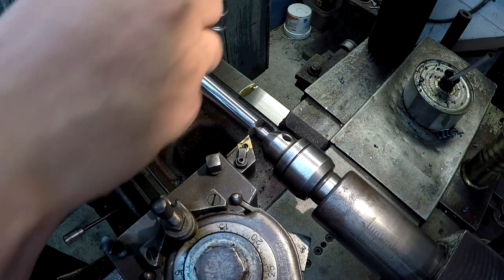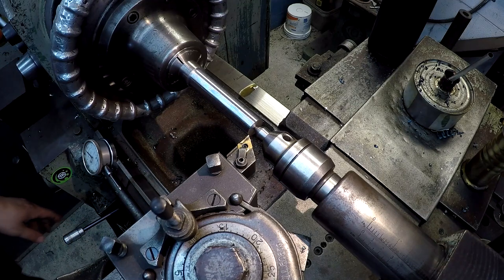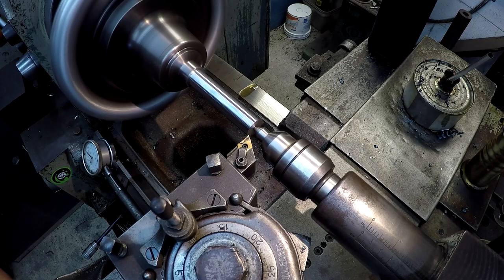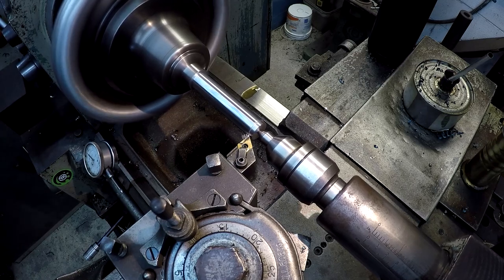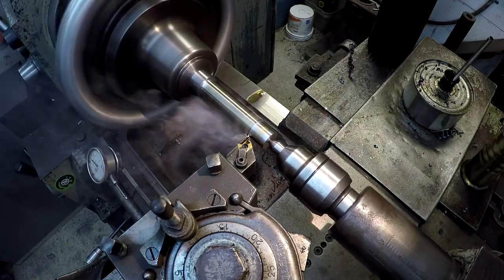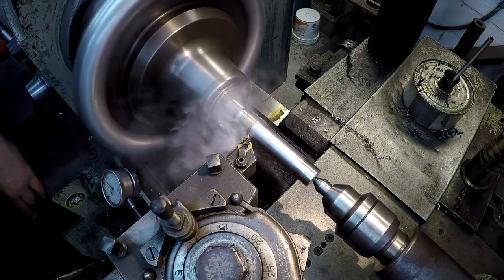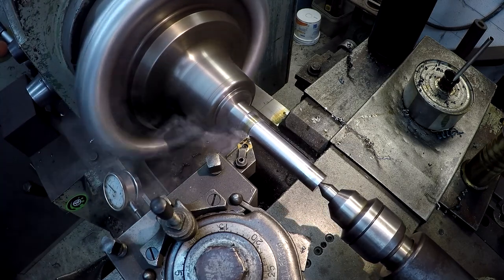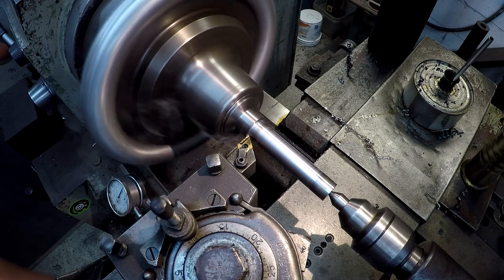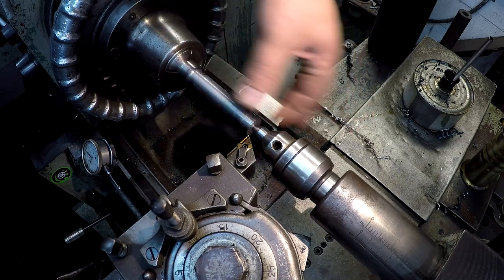All right, this is 802. So we got about 94. We'll do a 45. We're going to slow the feed right now. I'm going to take 45. Let's see what kind of finish we get. Not bad. I'm going to put a little oil on here. Ain't had any good cutting oil smoked up in here a little while, so you know you got to keep the fragrance going in the machine shop, right? Okay, that's actually really smooth. Leave a nice finish there.